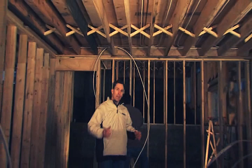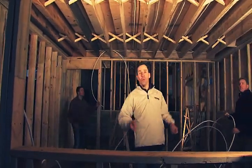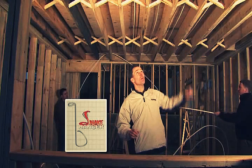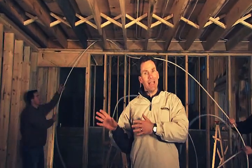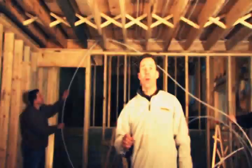Your other option in laying your tubing is to run it parallel with the joists. If you do that, you're going to hang it from the sheathing with snake hangers. They've done this half of the room, and now the guys are going to do the second half. It's important that you start in the middle, do one half, then the other. That way you don't have to pull the tubing through everything all at once.